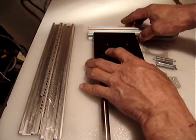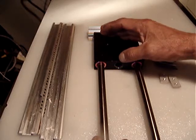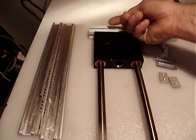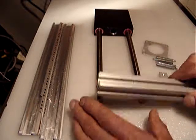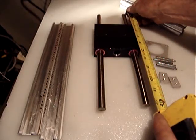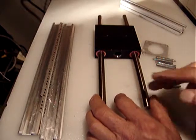But this is even to the top, so if you decide to mount your timing belt or lead screw on the side and the back, basically to not interfere with your front, you can actually mount in here some kind of aluminum angle, and from there work with both ends. So the length of this axis will be about 12 inches. Could be good for a Z axis or X or Y due to the size.